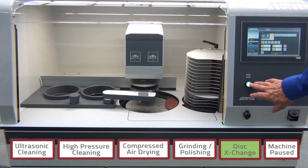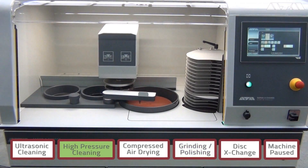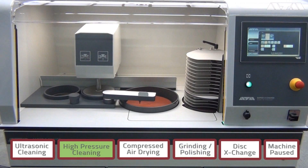Press the start button. The machine starts and moves the proper grinding disc into place. It raises the bowl to prevent splashing. As you can see, we're going counter rotation with water as our lubricant. We have enough power that we can actually run counter rotation for high removal applications or same direction rotation for the process.